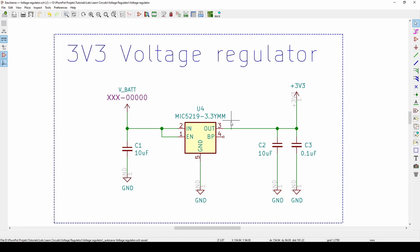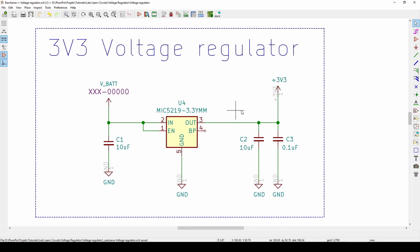How quickly it drains depends on how big the capacitor is. Sometimes when you switch off an appliance at your house you still see an LED burn — those are capacitors keeping the charge. It's the same principle here. If my 3.7 to 4.2 volt input drops a bit lower for a millisecond, the capacitor will make sure I still have 3.7 volts. On the output side, if my 3.3V toggles between 3.1 and 3.4 volts, the capacitors keep a constant voltage.